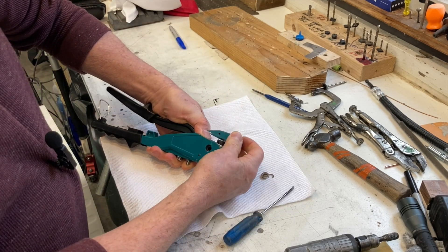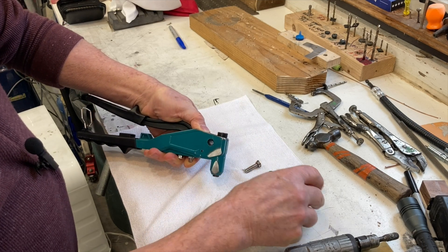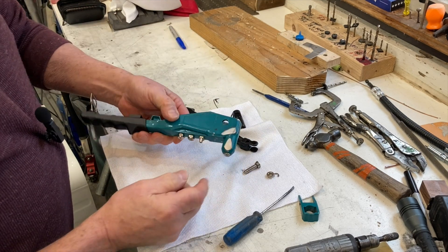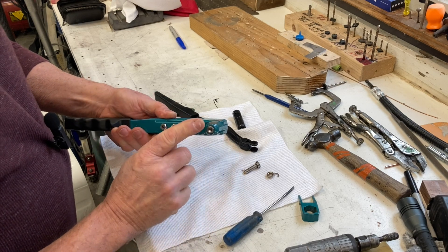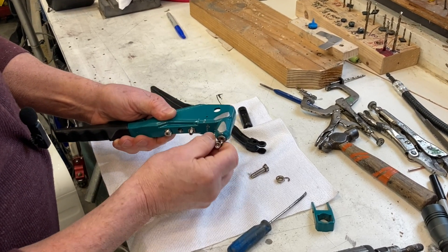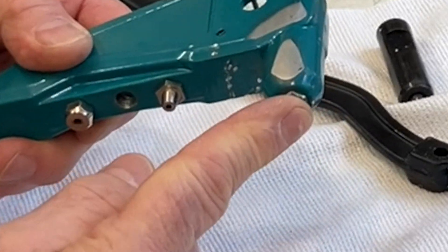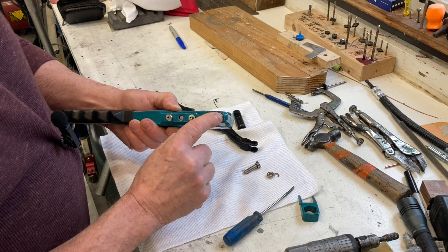Before I cut this top off, as you can see there was a little press pin up through here that just stopped the handle from going up. Let's get that out of the way. That's all there is to a rivet gun if you've never had one apart — except for the tip. One of the great modifications was taking a tip that's this deep. The first thing I did was grind this tip off and get it just as thin as I could and still be able to get a wrench on it.